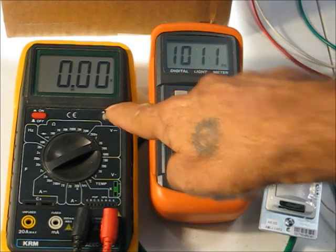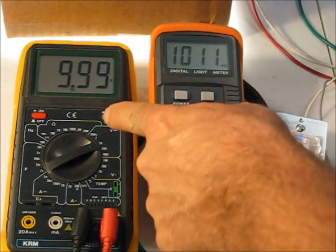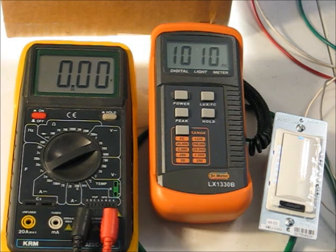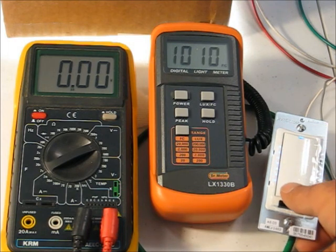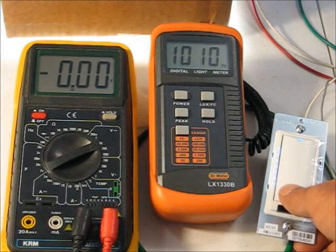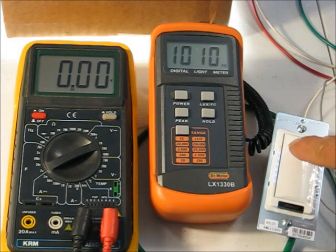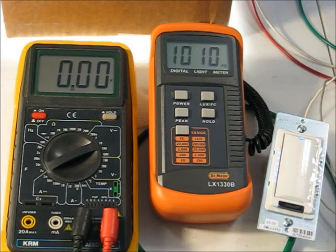So what do we mean by trimming in the control? I have a voltmeter to show me my control voltage. I have an area control all the way up. I've got just about 10 volts even here and 1,000 foot candles from my calibrated cardboard box. This multi-level control has 7 indicators on it, each capable of dimming down halfway. In fact, I'm going to hold this button down and count to 2 fast. 1, 2. I've taken out the top indicator completely and we are still at 1,000 and change.